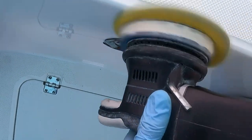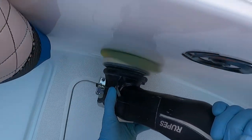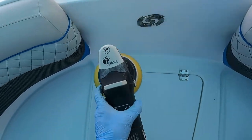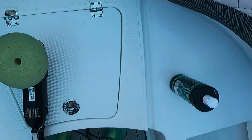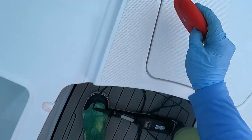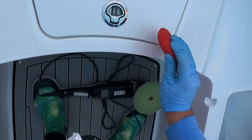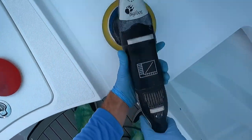I'm not going to wax inside the compartments — I'm just going to be waxing around the compartments and all the hatch tracks, but not actually inside. It just doesn't really make a lot of sense. You could go with an SiO2 spray if you wanted to. But a lot of boaters simply keep life jackets and supplies in their hatches, so the key for hatches is cleaning them really well. I don't usually spend time waxing them because you're not going to see it most of the time — it's just storage and it's not getting any sun exposure, so it's not going to have oxidation build up.